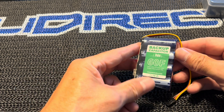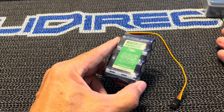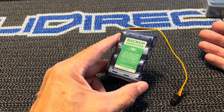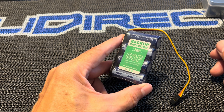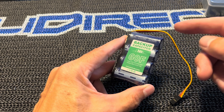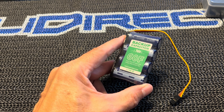Why do you need a backup capacitor? Well, just in case your power unplugs in flight — let's say you have a poor solder joint that fails, or just the connector unplugs; sometimes that happens and you lose power. This capacitor is going to take over and provide your system with power so you can safely land the model.